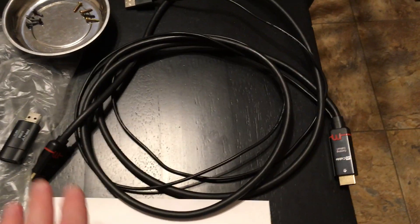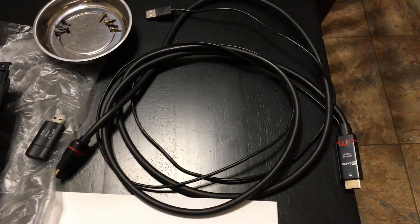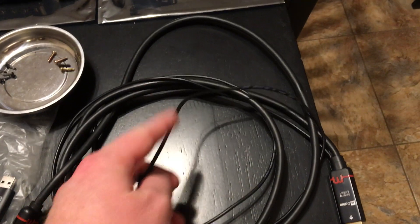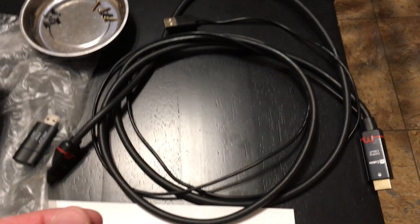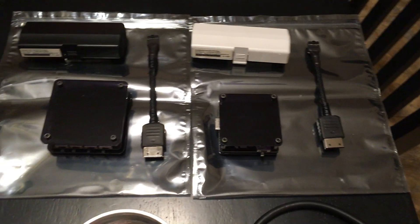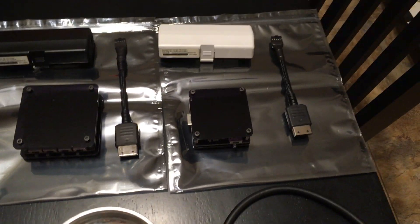What I've been doing is using those boxes in tandem with a thing called the M-cable. The M-cable is a video upscaler cable that introduces no lag and does a two-to-four times anti-aliasing effect. It has a USB and an HDMI in from the console and HDMI out to the TV, with a little circuit board inside that upscales content to 1080p and does anti-aliasing. I found that this fixes the horizontal shifting and also cleans up noise from the analog VGA signal.